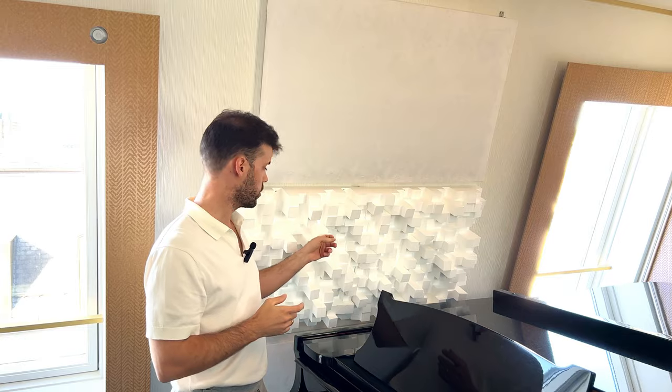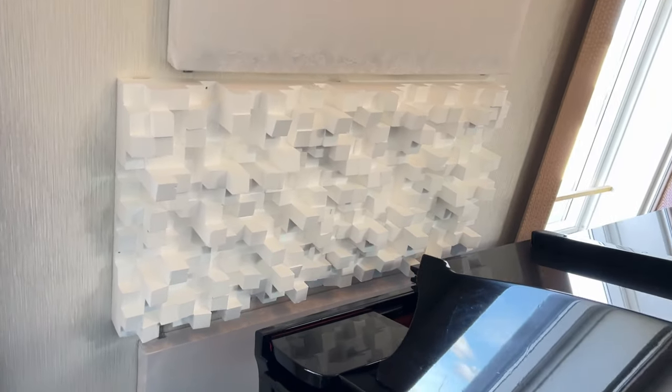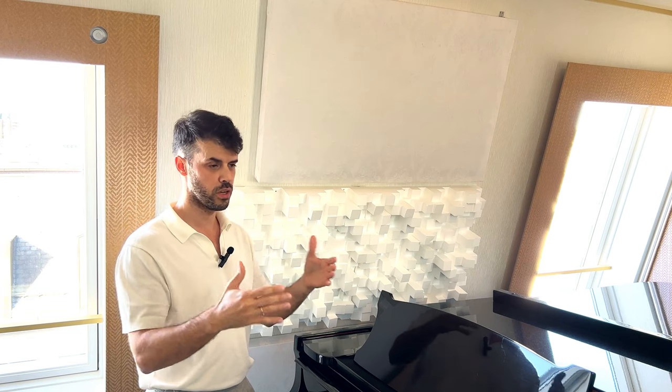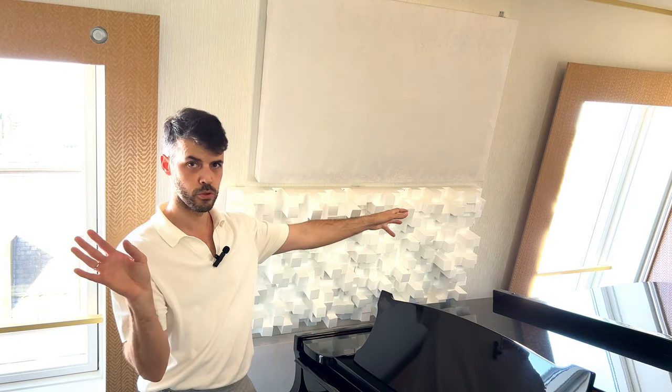If you want to keep improving — if it's still too loud or you want to make the sound even softer — you can start adding panels on the walls. The big problem with sound and reverberation is every plain flat surface. This here is actually a sound diffuser that I bought online — I'll put a link and price in the description. It makes the sound go in all directions, because you want to avoid the sound going straight to the wall and bouncing directly back. Instead it gets dispersed in the room.